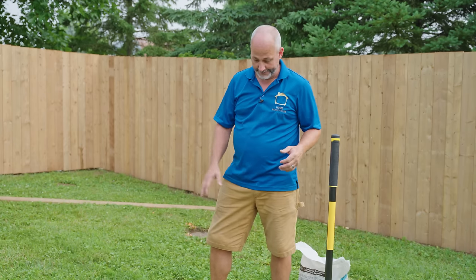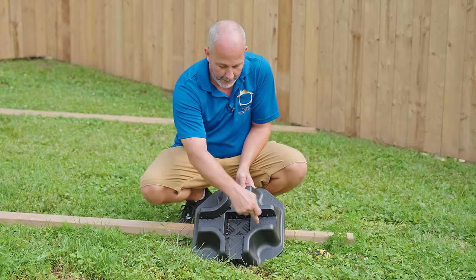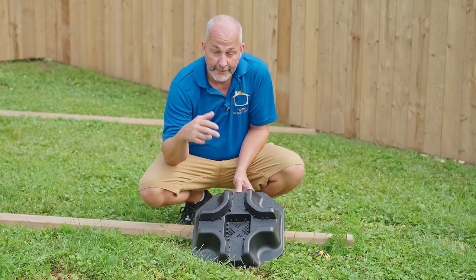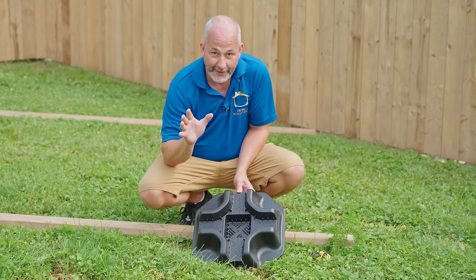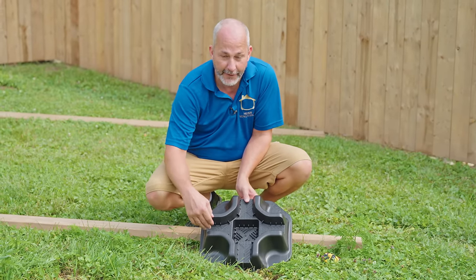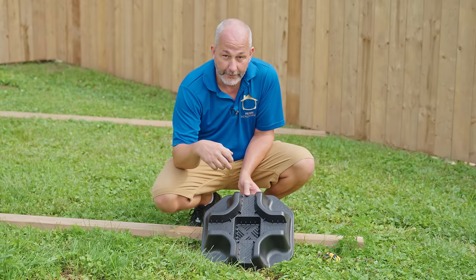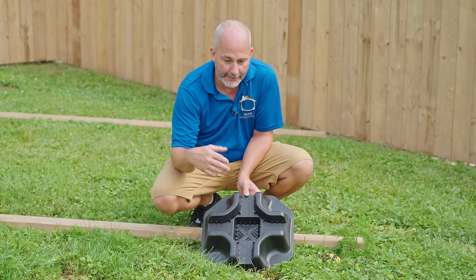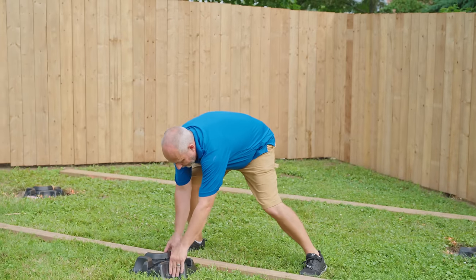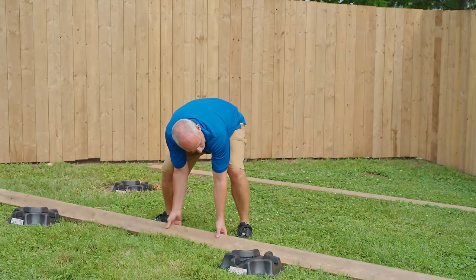The versatility of this block is that we're using four by four posts, but you can also put in a six by six if your structure requires it — that's very common if you're going to be putting a second floor deck. This ridge here is one and five eighths, which is basically the thickness of a two by lumber, and this ridge here is two inch, which is the same as LVL. So depending on what material your design, engineer, or architect calls for, this solves every single problem. We simply line this up so that the one and five eighths is going all the way across, and you can take your lumber and that's it.